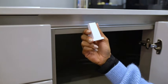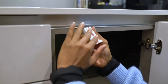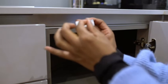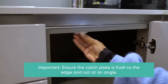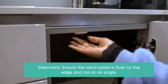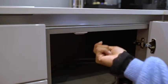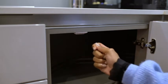Remove the applicator and carefully replace the film lid onto the sticky tape. Gently remove the film from the back of the catch plate and firmly stick the catch plate on the furniture wall. It is vital that the catch plate lines up with the two pencil marks to ensure that the lock can hook onto the catch. If it doesn't align, the hook will not reach the catch and your furniture will not lock.